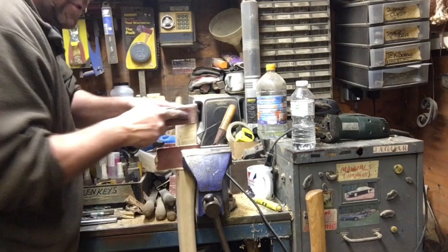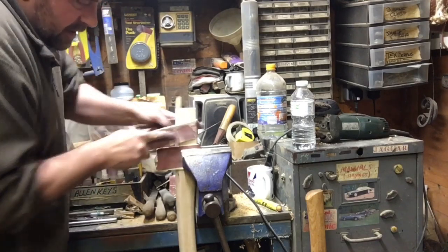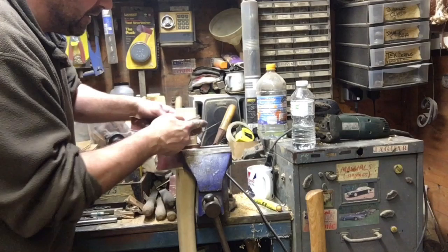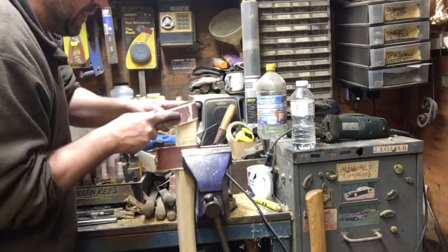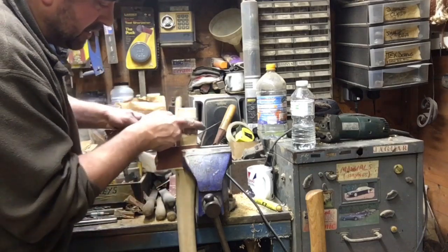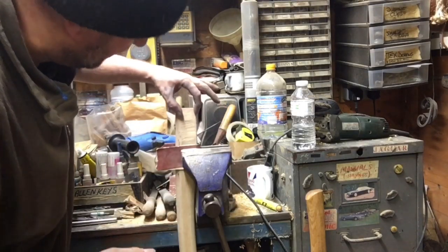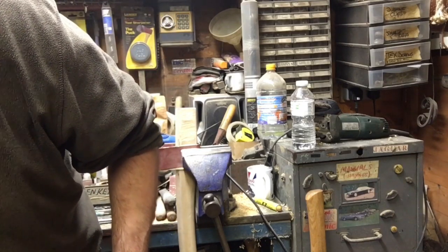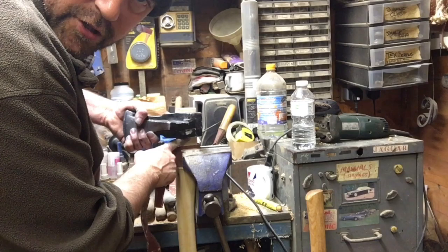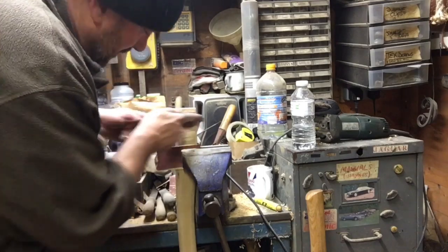If I'm a little thick and heavy on one side I can concentrate on that area specifically to iron out any variability. Within reason — it's a splitting maul, not a chopping or felling axe. What I'm doing is sanding the area to give me a finished area which is as deep as the axe head plus half an inch — that's what I usually shoot for. I'll bring you back when I get somewhere near.